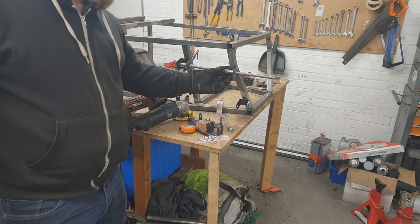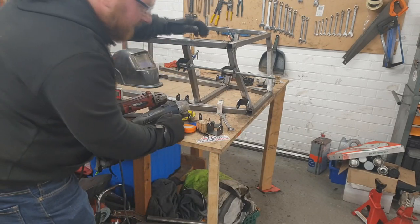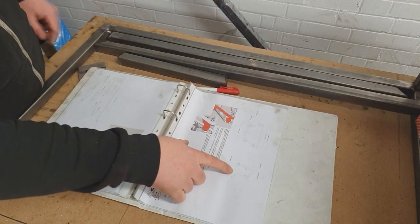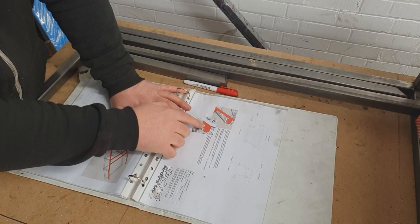So as you can see, we're in two with all of the brackets shortened by 20-odd millimetres, and this is now sitting a bit closer to where it was supposed to be. We need to flip to a new page. On the page we've just hit, you'll see there's a number of geometry pick-up points that allows us to know exactly where these brackets need to sit on the front of the car. The problem we're going to have is because this deviates a lot from where the original plans were, there are going to be mad gussets needed to add strength, simply because where these brackets go in the front of the car, there's just no meat for them to land on. So we're going to have to add a bit of strength here.